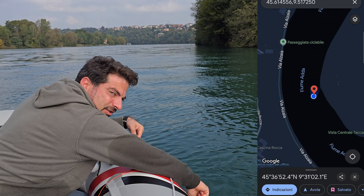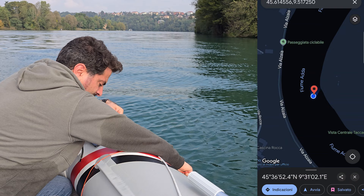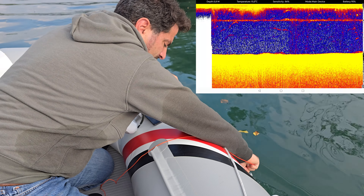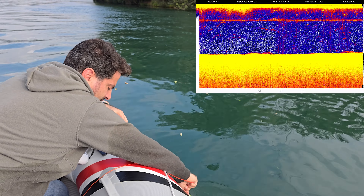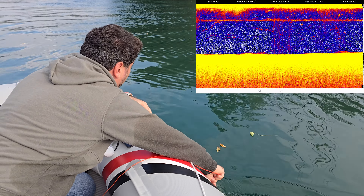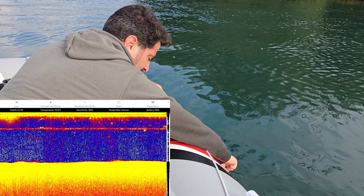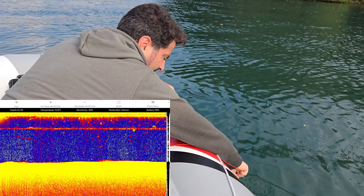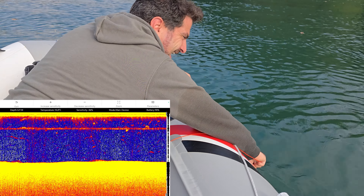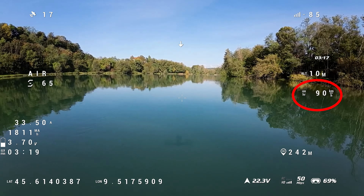It can work on its own or mounted under the drone. First we'll use the sonar alone to save energy, then we'll mount it on the drone and continue the search. Now Jacopo is lowering the sonar. This is what you see on the sonar without zoom — this is the bottom, these are hard surfaces; everything red and yellow is a slightly softer surface. These are probably fish, which we're not interested in. Here there are some hard surfaces. We're at 6.4 meters depth at this level — the sonar also gives you water temperature and you can adjust the sensitivity.